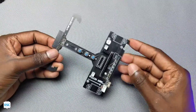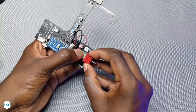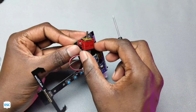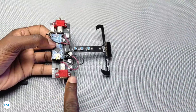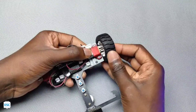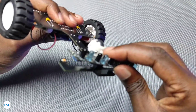After completing all the soldering, our PCB looks like this. Now I inserted the motor driver and Arduino Nano into their sockets. Then I placed and secured the N20 motors to the PCB using the motor holder. Then I attached the front caster wheel and the main wheels to the motors. Finally, I connected the motors to the PCB, attached the OLED, and the sensor array.